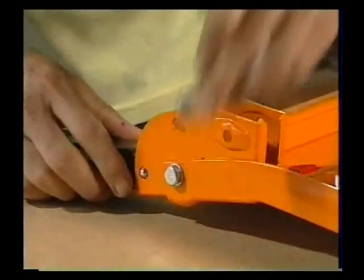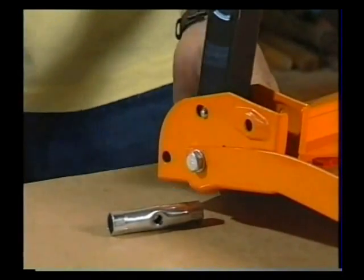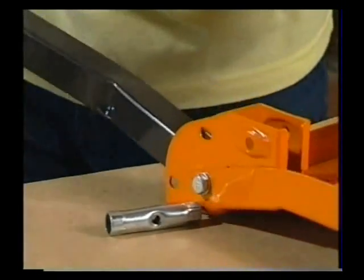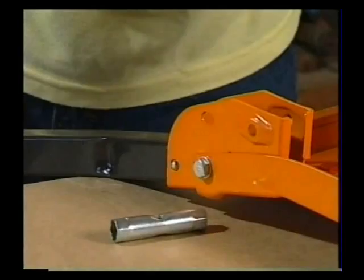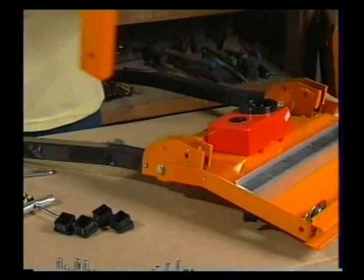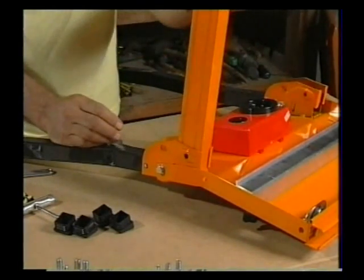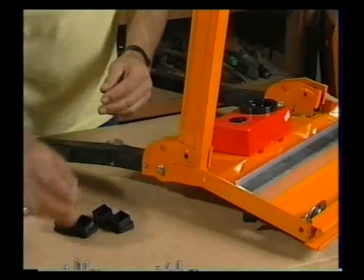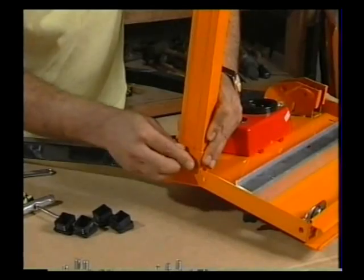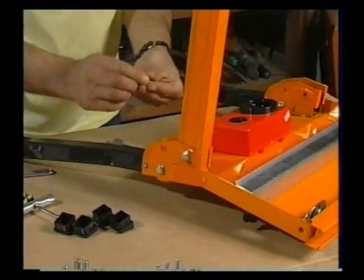and to the point where you can push the leg lock pin, move the leg up into the parked position and move it down to the lock position. Once you've got the four legs fitted, you can fit the base channels, and they simply go into the sockets like so, with the open faces of the channels facing inwards, and you get another of your long bolts, again with a washer under the head, pass it through this hole here, and then another washer and a nylock nut on the inside.